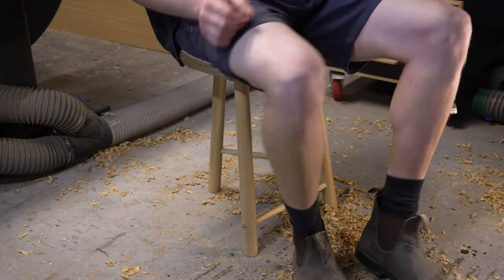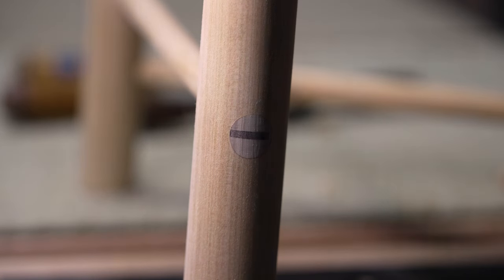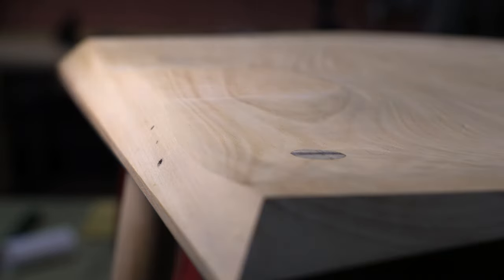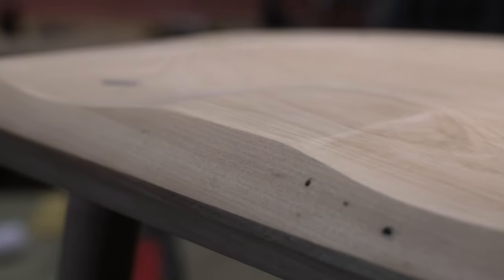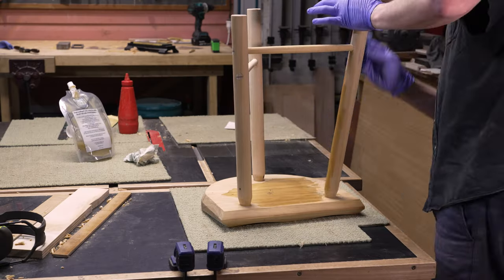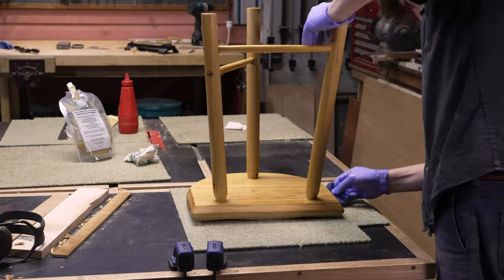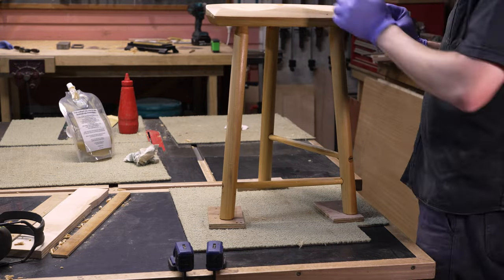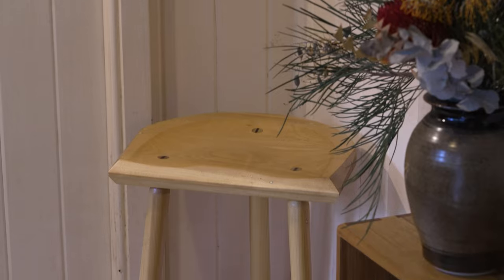There we go, now I'm done. Bloody shavings everywhere. I actually went back and attacked that top even more — I just thought it needed more cut out of it. So that front edge now doesn't have a straight line at the top; it actually scallops out for your thighs. I quite like the look of that. I ended up using a little bit of filler in those nail holes on top, just using some hard wax oil — probably did three coats in the end. Nice piece of scrap hoop pine which came up well. It's got a bit of character with the nail holes. Sometimes I feel like when you put in that much work you should use something a bit nicer, but at least it got saved from being firewood. I've got a real soft spot for hoop pine anyway — it's a beautiful timber and it's native to the area.